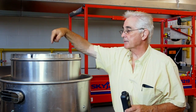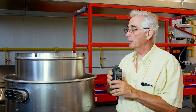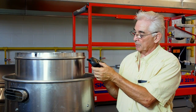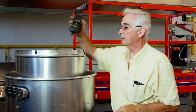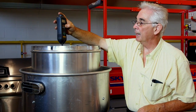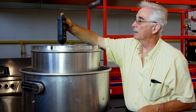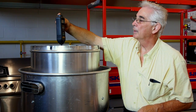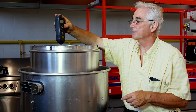Now we're going to measure how fast this fan is turning. I've shut it off because it makes too much noise to talk over. We have a tachometer set for contact, and the pointed tip goes in the end of the motor. Push the button and we get a reading of 1,725 RPM. I normally do it two or three times to take the average, but 1,725 — that's how fast the motor's turning.